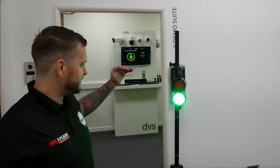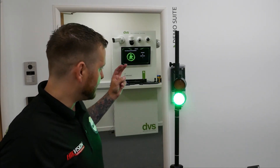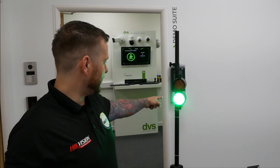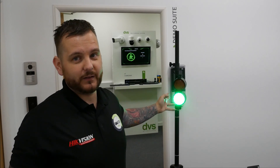I've used a simple double pole relay. From the people counting camera fitted inside, there's an output that latches when the store threshold is reached — the threshold is set to one on this for easy demonstration. The relay output on the camera will latch and drive a double pole relay, which will then drive it green or red depending on the relay state. This particular traffic light needs a 48-volt supply, though a 12-volt version is available. The relay itself is 12 volt.